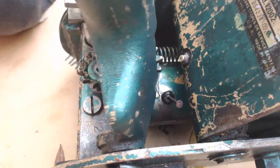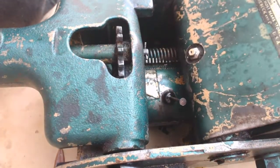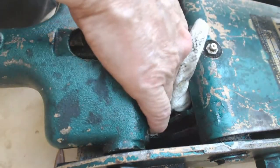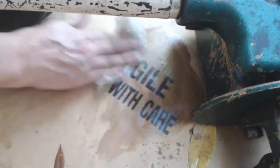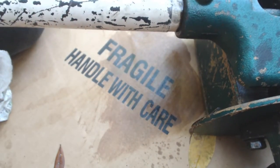Once I've completed this check, I'm going to go ahead and pump the jack up completely all the way to the top of stroke to try to bleed out any possible air that may be in the jack. Then I'll let the jack down, pump it back up again, let the jack down again and pump it back up. All the while at the top, I'll be pumping the handle to make sure there's no air in the system.